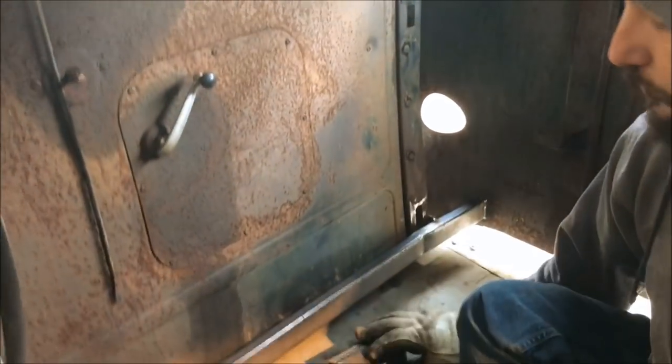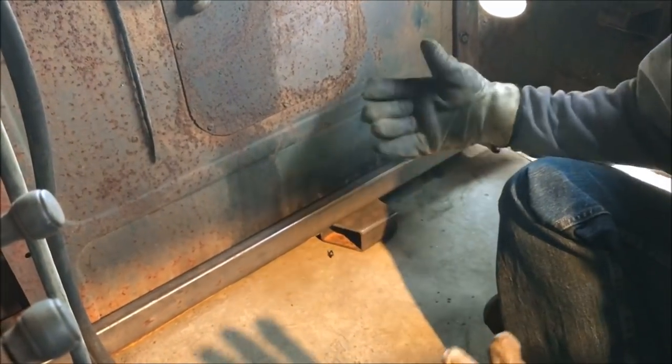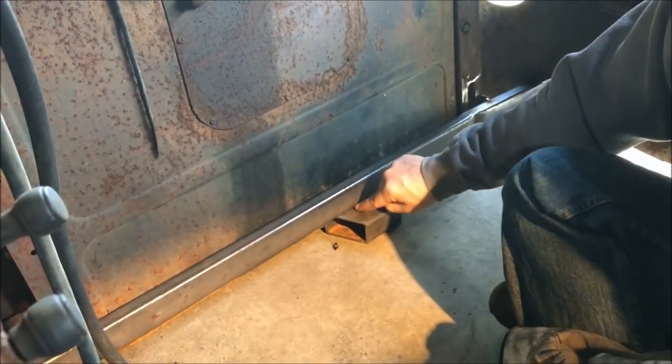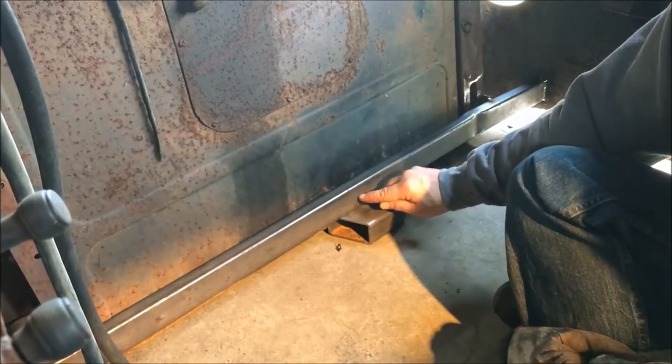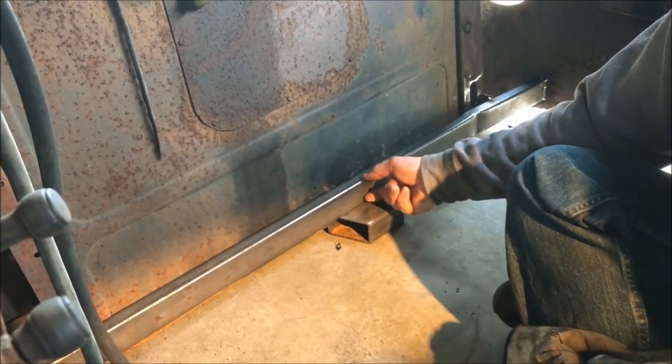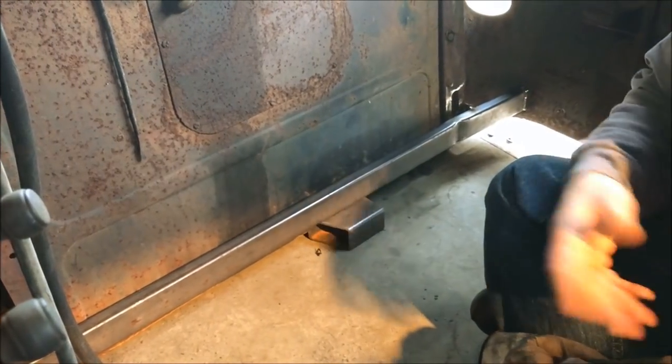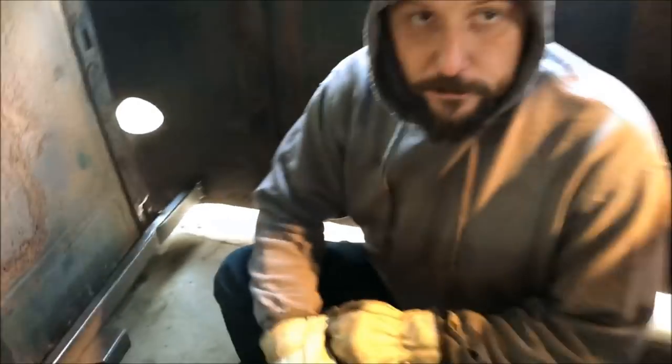So I've taken 2-inch, spaced it from the floor. We're just working off the floor here, nothing special. So we've spaced it here, and then we're gonna have a piece of 1x2. So then that'll make for our 3 inches of frame. And then we're gonna come across off of this piece with 1x1 all the way across and make a floor off of that. So anyways, we'll get to it and we'll show you how we do this stuff.